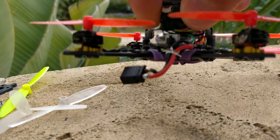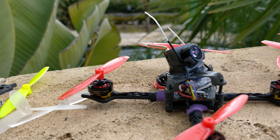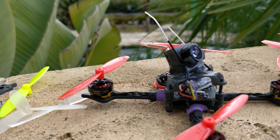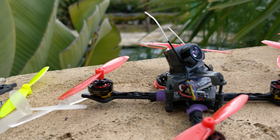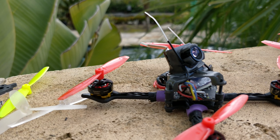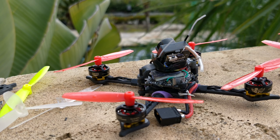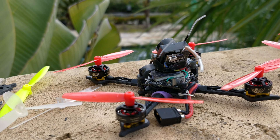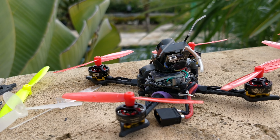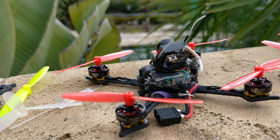The next big point I want to make is about the XT30 connector. I was testing various powertrains and then I started testing the XT30 connector. I had read before that adding an XT30 to a 2S whoop increases performance quite a bit, but I am shocked at how much. The number one upgrade to this little thing has been just swapping out the connector for an XT30 — immediately I had about 30-40% more punch, maybe 30% more speed, and 30-40% more flight time. It doesn't even make sense how much gains there are to be had by just switching a connector.